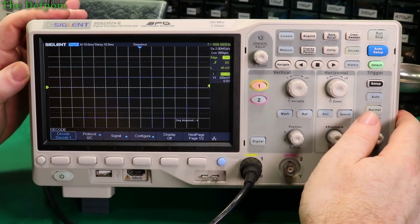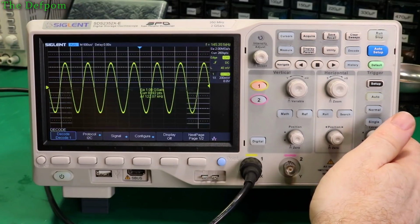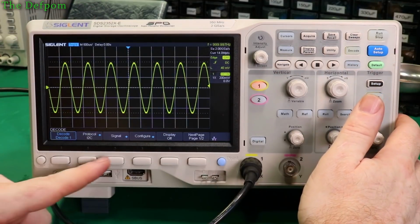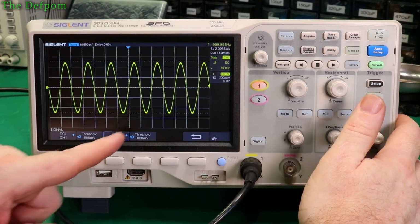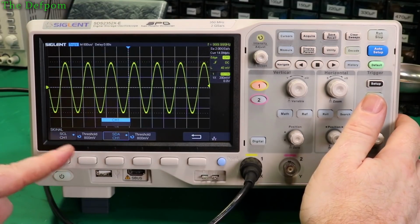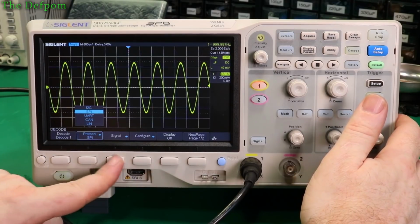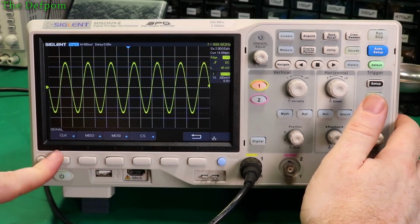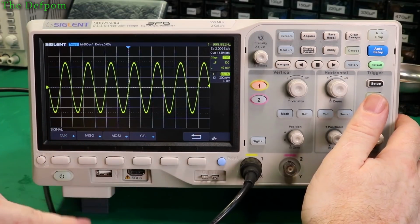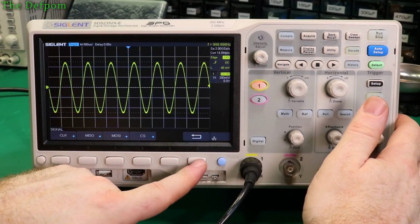Let's go back to the default setup. Hold on a second. Clear it all back up again. So back to decoding. So you've got the signal levels, as I said before. You can choose what they're doing, you know, SDA, because there's a particular type. Let's do an SPI instead. Then you can choose the SPI options there, you know what channel you're going to use for each one, chip select and stuff like that. You can do all that there. So that's where you set all those up.